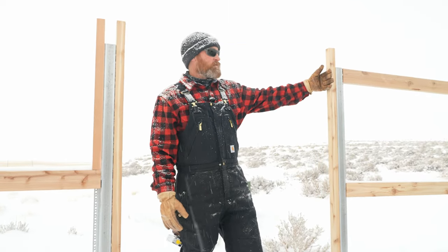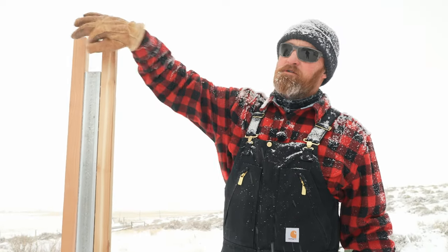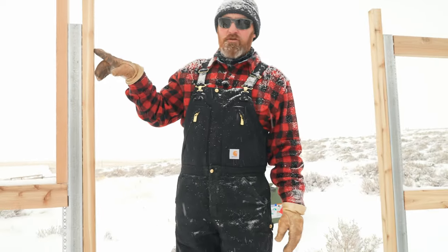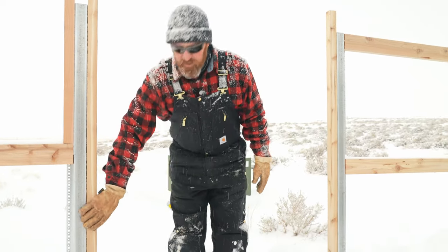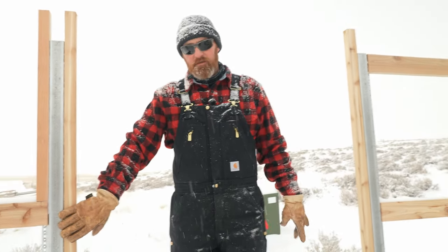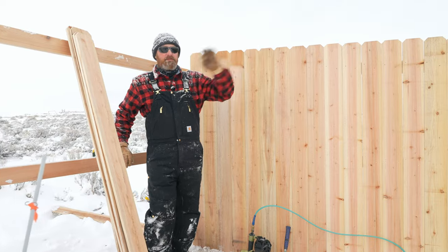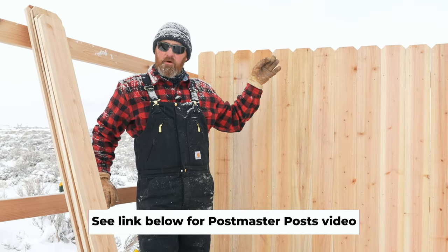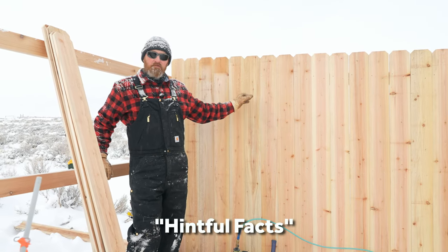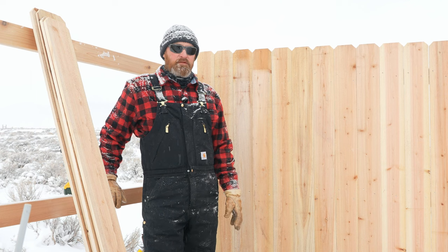When you come to an end with the Postmaster post going into your fence — in this case it's going to be a gate — these are a little taller than average because of the way this customer wants his fence built. He's going to have electrical fence wire up here so we added some support. Normally they'd be flush. This is how you'll finish the end of the Postmaster: take a 2x4, rip it in half, run a couple screws on the backside to hold it in place. That'll give you a place to nail your last picket, or in our case it'll be hinged on one side with a latch on the other, and we'll nail a picket on the backside to cover it up. So that would be the basics of how we build a cedar fence. That's the basics of how to put pickets up — I threw in a couple of helpful tips along the way. Any questions, just post them below and somebody will get back to you. Have a great day.